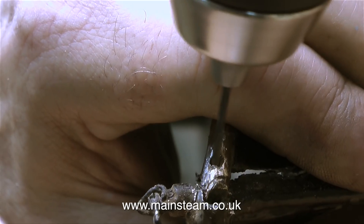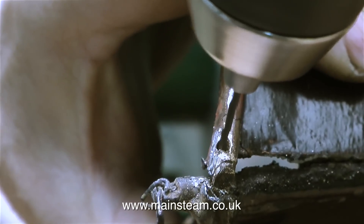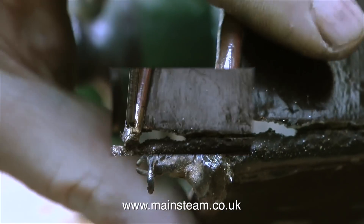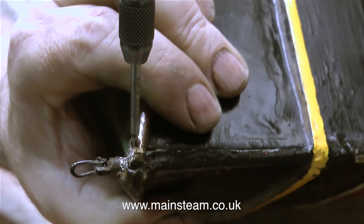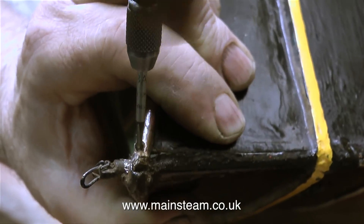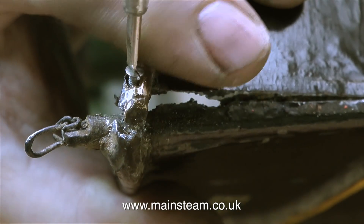With the Makita drill I had no problems. I'm drilling a hole through the side of the combing which is clearance size for 8BA. I then change to a smaller drill bit — tapping size for 8BA — and drill through into the round brass bar that forms the front of the bow. Once done, I thread the round brass bar using an 8BA tap, being very careful not to break it off. I'm tightly holding the bow in position so the tap enters the hole at the correct angle.